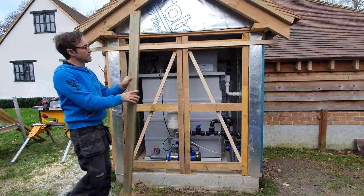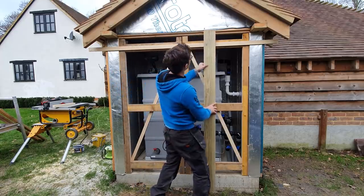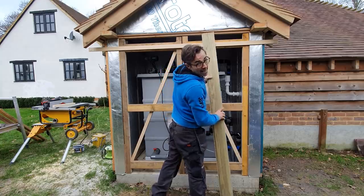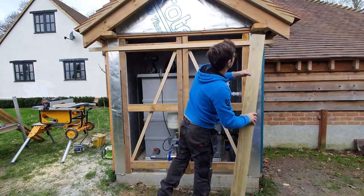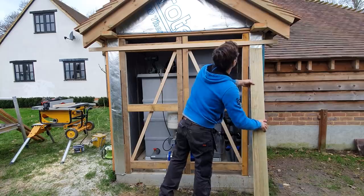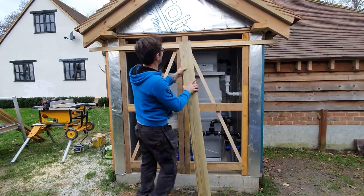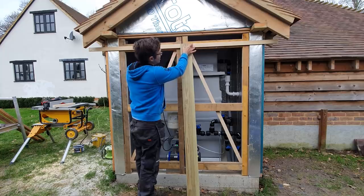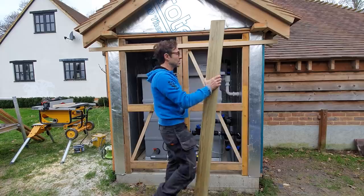Now the idea is I'm going to use this cladding all the way through these doors. It's going to come up underneath this drip, and the top cladding is going to hang down to it, so anything will come off, run down and go off the bottom. And this cladding will go right over to the corner posts that are going to go onto here as well. So what I need to do is work from the middle and back. I've got to decide whether I cut the tongue and the groove off and have a narrower section here, or I try to match the outsides. Well, let's see how it works out.